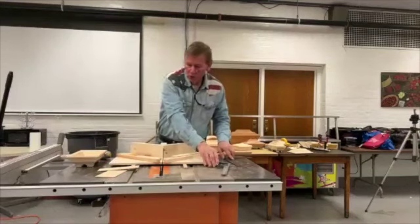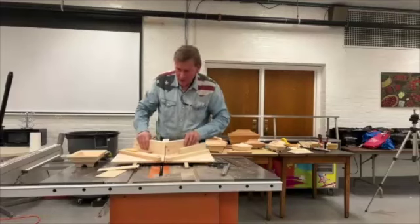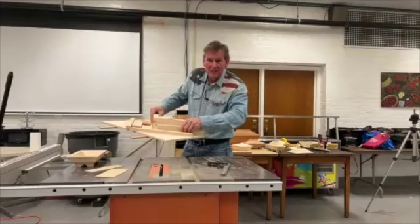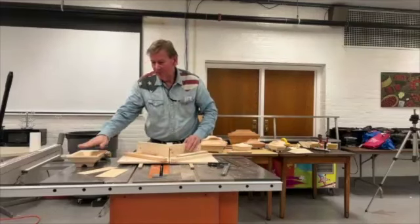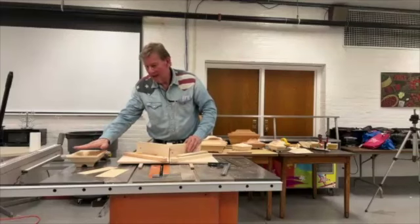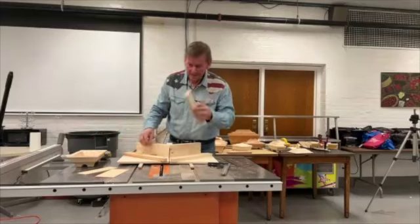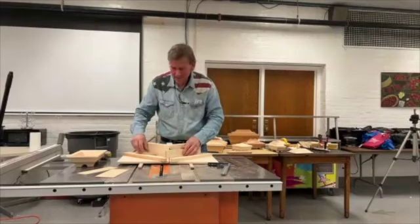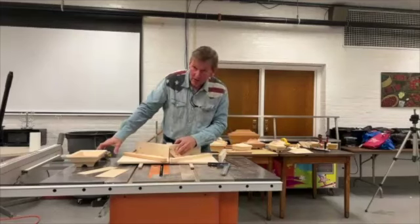That's the measurement you're going to use to set your height. If you look on this jig, you'll see a bunch of little lines. Those are the heights of each box. Once you have that height reading, the height minus the height of the box plus this angle depth is this height. You would take this, make yourself a mark, hold your molding against that mark.